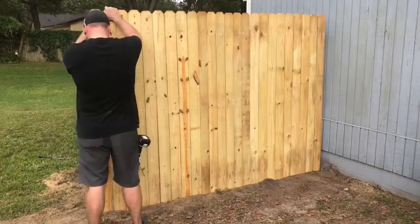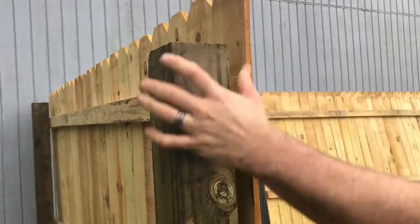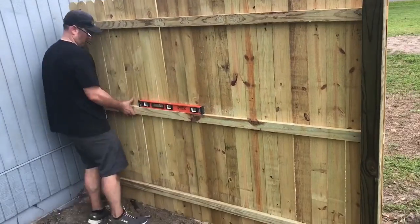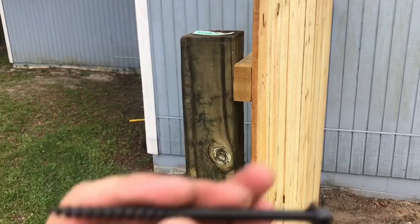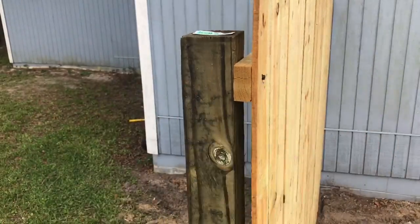Time to install the first panel. This is a very simple process — I'm going to install three-inch screws right through to the fence post. This isn't going to be the final method of installation; I'm actually going to use five-inch lag bolts. Once one side is installed I make some micro-adjustments to level it up, run around to the other side, and install those screws as well. Here are the five-inch lag bolts — I'm doing three per post.